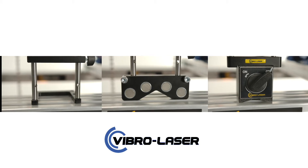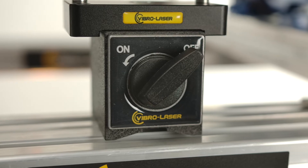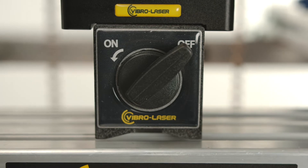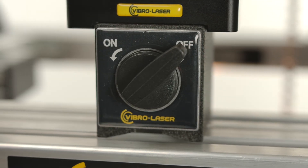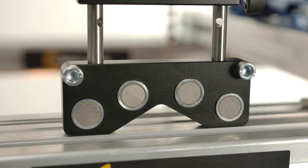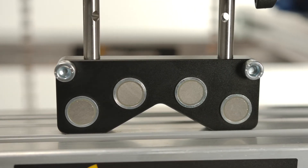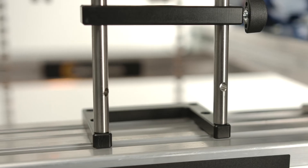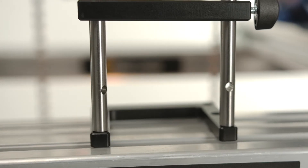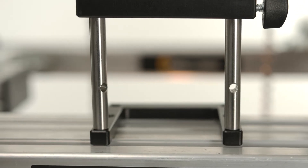There are various types of mounts, each of which can be purchased as needed. Measuring units can be mounted on large diameter shafts with the magnetic base, which is more convenient than multiple extension chains. Magnetic V brackets are used for mounting the measuring units on the side of the coupling with strong magnets when chains cannot be used. Offset brackets are used in the case where the minimum distance between the measuring units cannot be achieved, and this type of mounting allows you to take out the rods for convenient installation.